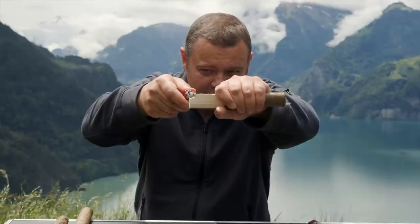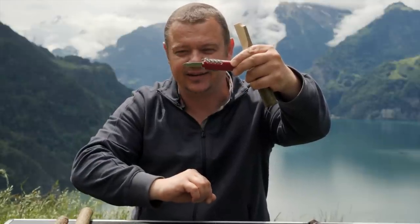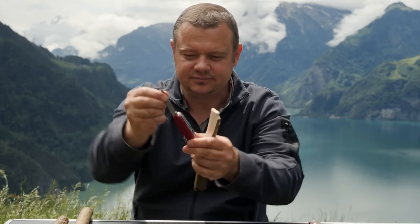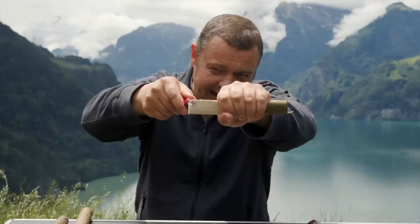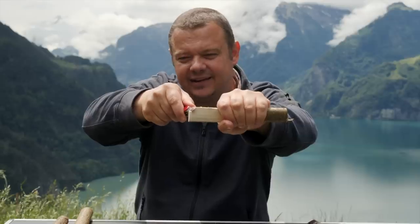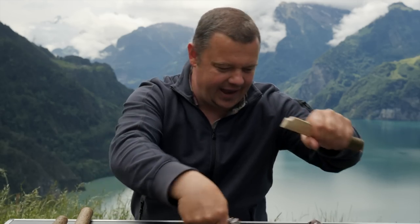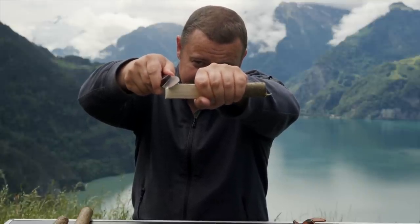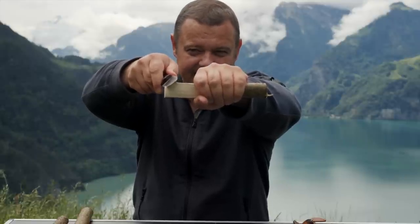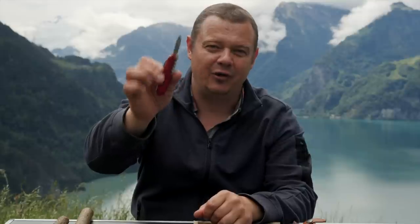Third advantage: with the small blade you can carve tighter turns because the blade is less high in this dimension. When I try to carve this radius with the big blade, the side of the blade will touch the start of the radius and at the end it's more scratching than cutting. And if I take a bigger knife like this, it's even worse than with the big blade. So with the small blade you're much more agile for carving tight turns.